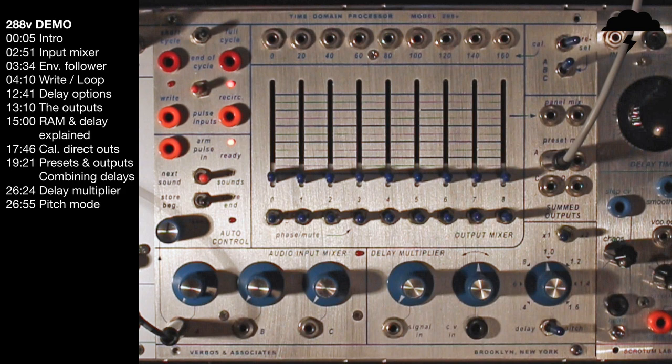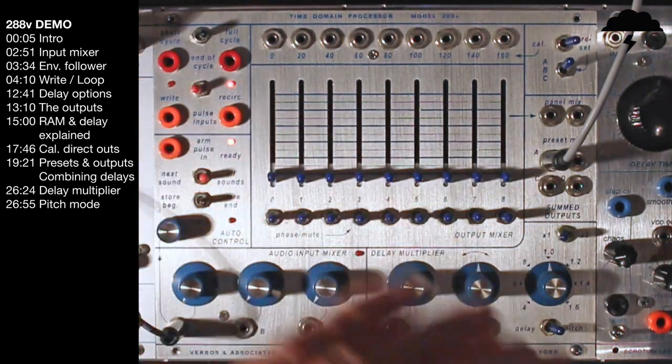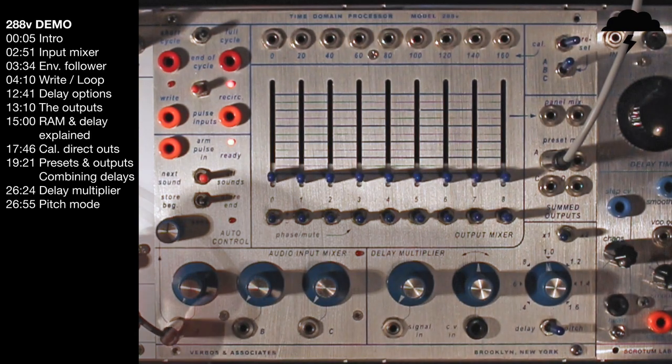The LFO has to reset at some point and there will be an audible glitch. The sense knob controls the threshold of the envelope follower that resets that saw wave. If the sense knob is set just right, it will reset at the beginning of notes and not sound awful. Be aware that this mode only works when chaos is what you're looking for.